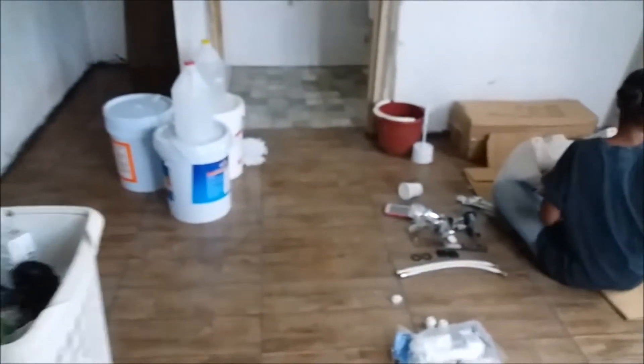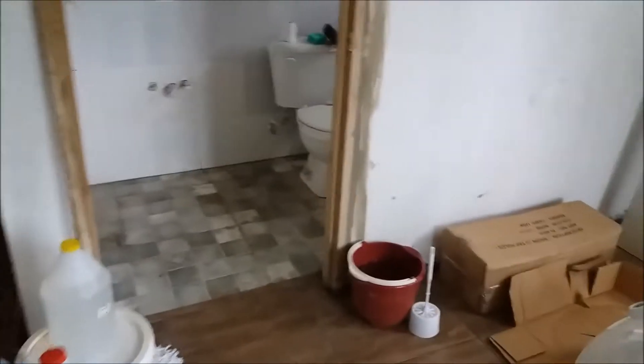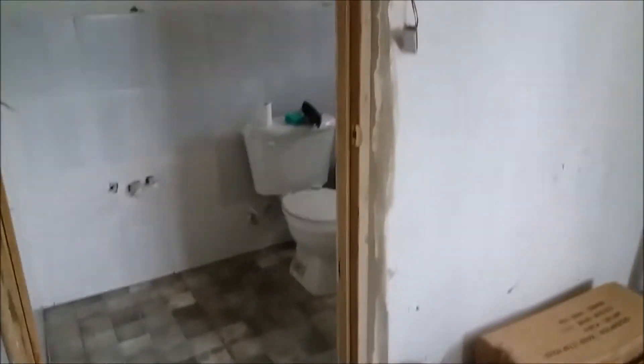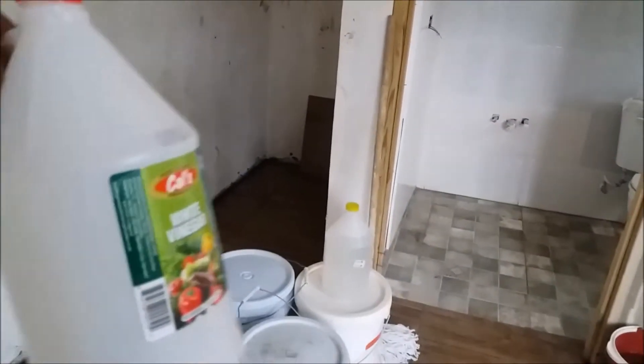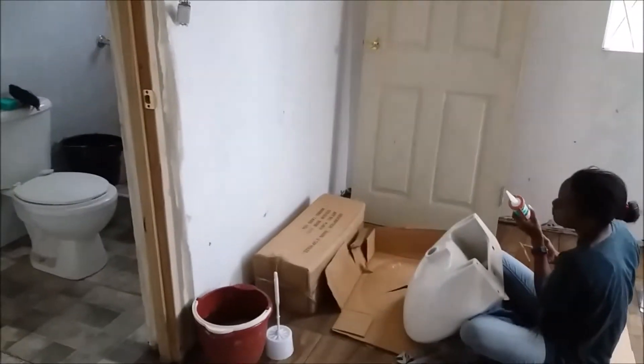This is one of the bedrooms or the bathroom. I'm actually now trying to clean it up. What happens is the tile will leave what we call grout haze — that white, hazy look you see on the tile itself. I'm using a basic household ingredient: white vinegar, full strength. This is a Kals brand.